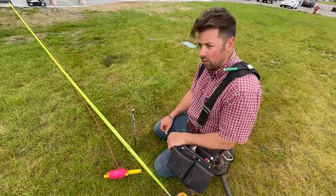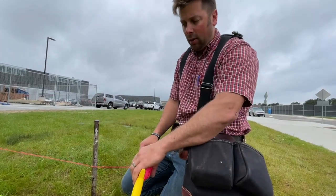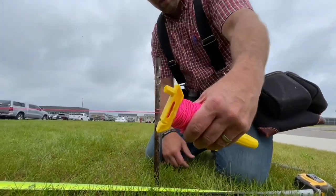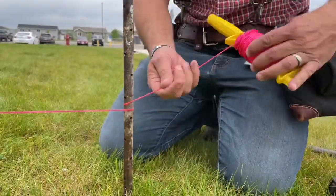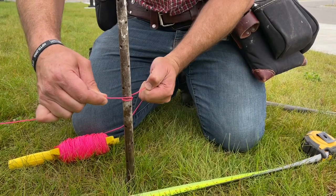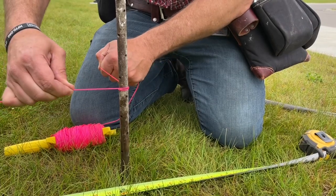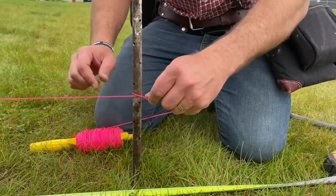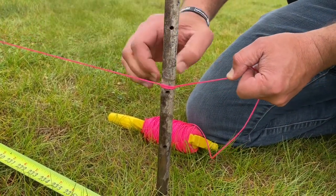Let's go over the first of our two knots. Really, it's not a knot — it's just a way to fasten a line. I want the line to pull off of the inside of the stake at 20 feet. This is called a mason's knot: go around the stake once, grab here on the line you want to pull and here on the tag end, then pull that slack up. Allow it to cross over itself with the crossover right on the back side of the pin. As you pull up and keep that crossover there, the line in tension bites into the tag line. Let it roll over itself and lock on the back side.